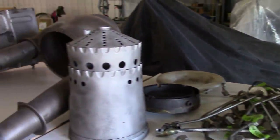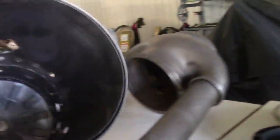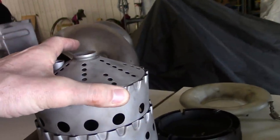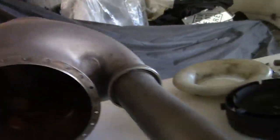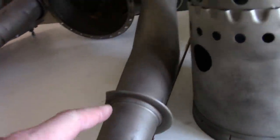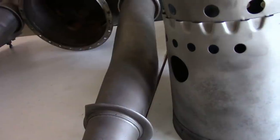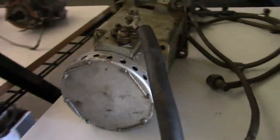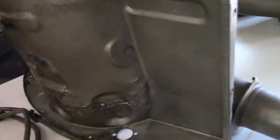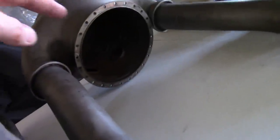This is the combustor liner — very simple. This is what keeps the air flowing where they want it to go and away from the combustor outer case, which is that thing. These are the air transfer tubes that take the air from the rear of the front of the engine to the front of the rear of the engine — they're going around the gearbox, which is the center of the engine. This is the starter generator, igniter box, this is the heat shield, which keeps the heat of the combustion away from all the accessories.